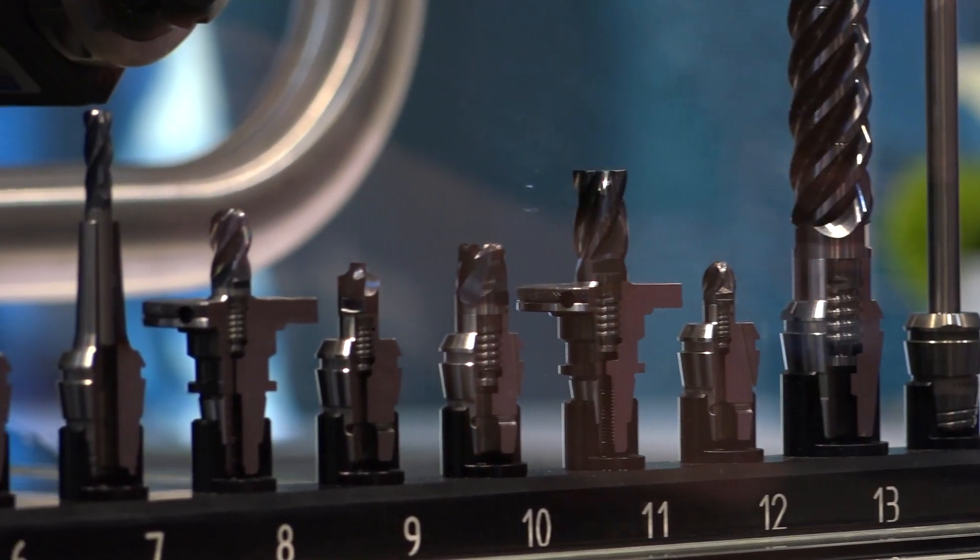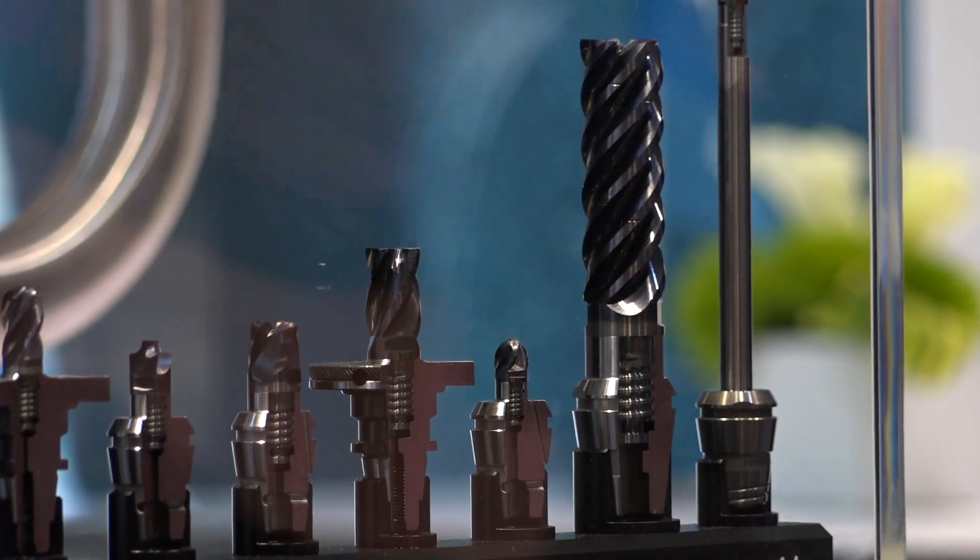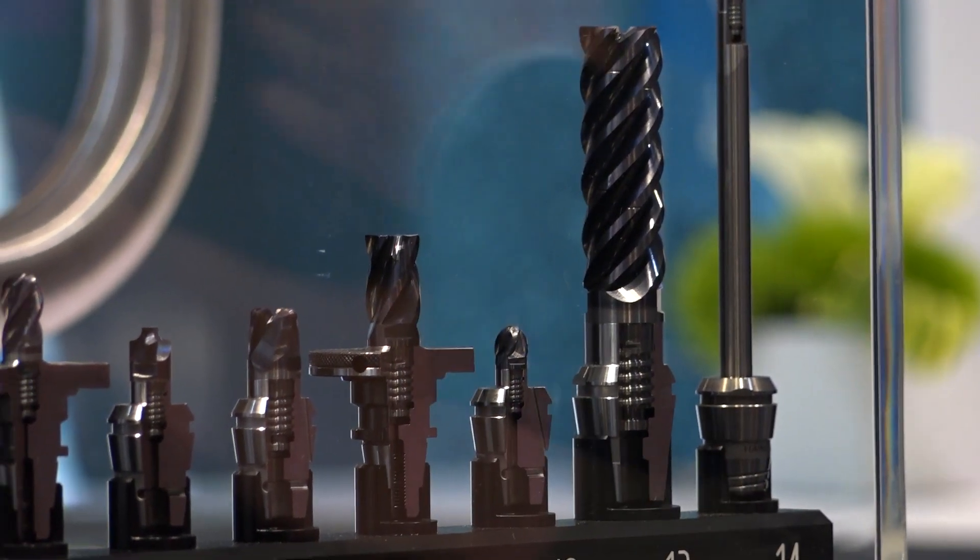You can use it like a shrink fit collet, a dual lock collet, with the great advantages: highest rigidity, three micron runout, great stiffness. And the most important advantage is you can prepare it and set it up offline while your turning machine is making chips, while your lathe is making chips. There's no opening up, bending in, putting in the collet, setting up for the lengths and wasting and scrapping the first part.